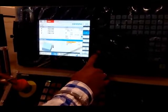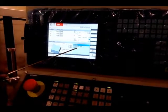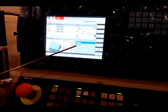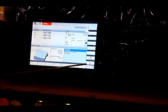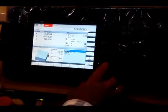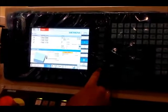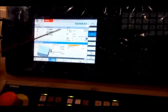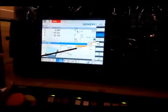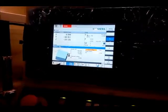When I press the 'Set Work Offset' command, there will be a pop-up window which says 'Activate Work Offset G54,' which is a command for work offset. Either you need to cancel it, or you have to press OK to accept this command. By pressing OK, I will activate the offset command. Now you can see that the work offset command is activated and the 'Set Work Offset' tab is highlighted.